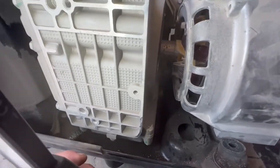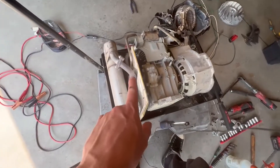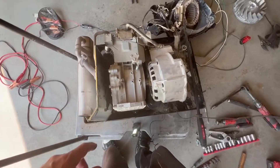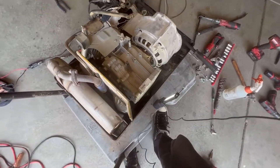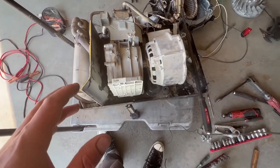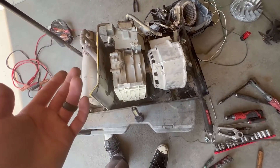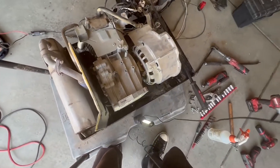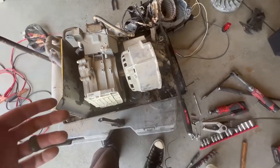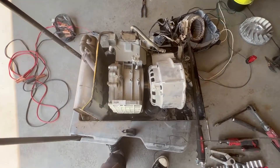We've made the case that it definitely needs an engine. What I'd like to do next is take off the exhaust, put this engine up on the workbench, pull the timing cover, and see what happened. I did not find any type of oil level sensor, so there's no way for that computer to shut it down — it doesn't have that information. I think the owner was misinformed about this generator's ability to do that. It is a pretty smart, well-built generator, but it doesn't have that function.